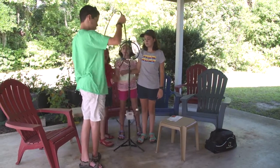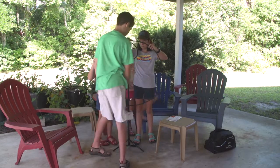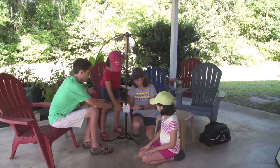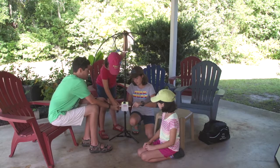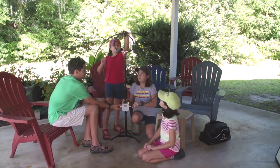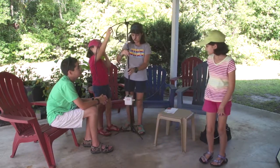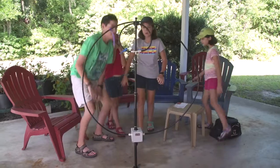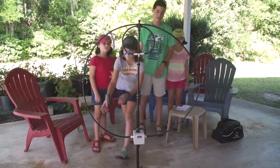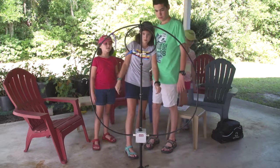Then you're going to straighten out this — it's a big coax loop, it looks like. And you hang it right on top of the other, and you screw in the ends to the matchbox where the connectors are on the sides. Now you try to center it by looking at it. It's easier to look at it from a distance. So it looks like it needs more coax over here — it's a bit more bent here. You try to make a circle that is even, and that looks about good.